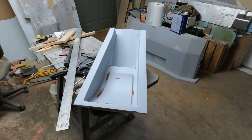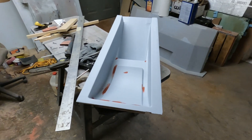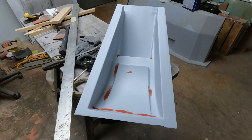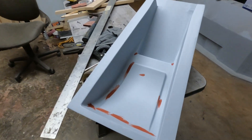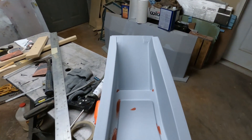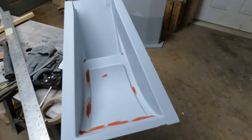I had hoped to have these two molds ready to make parts this weekend, but I just have not finished them. It's Friday afternoon and this mold is the farthest along. You can see there's a few little spots I need to sand. All of the areas except where the putty is are looking really nice. These spots with a few little spots of putty need to be sanded and the final coat of primer put on. But this is the lower center console that goes between the seats — it's kind of upside down — and this is where the phone charger would be. There'll be a cutout area here to drop the phone in.